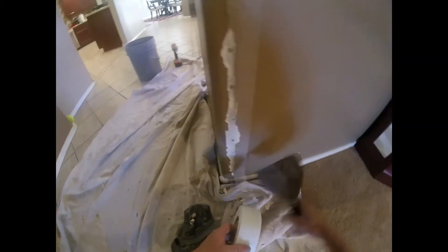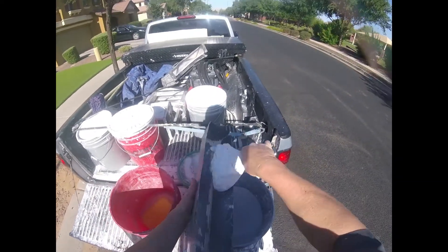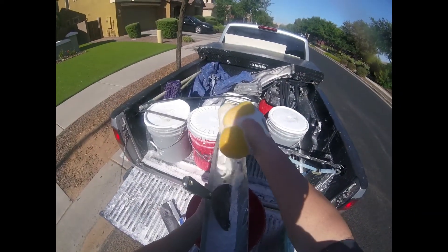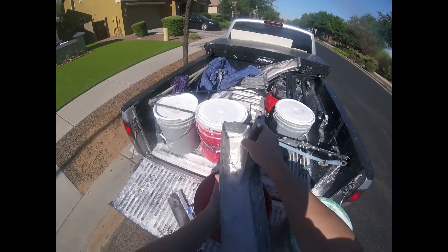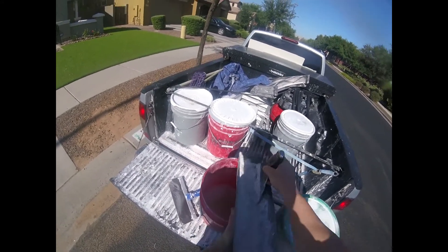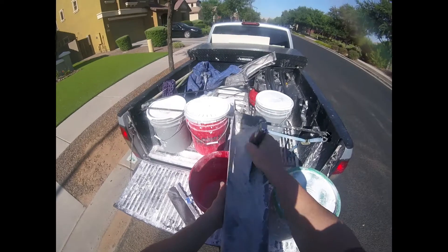What I'm going to do next is mix some five-minute mud. I'm not going to mix a lot — just enough to fill in the fiberglass gaps and do a nice first coat over this area. I use five-minute mud and I always keep it in a bucket because I work in the field and drive around. Some guys like to work right out of the bag, but I keep mine in buckets with the lid so it's preserved from water getting on it — it's good storage.